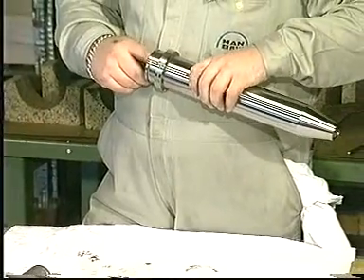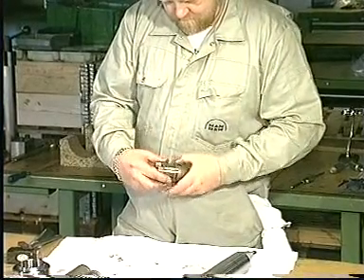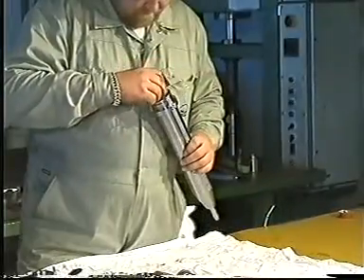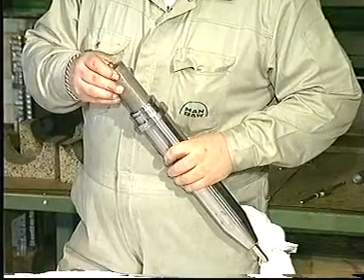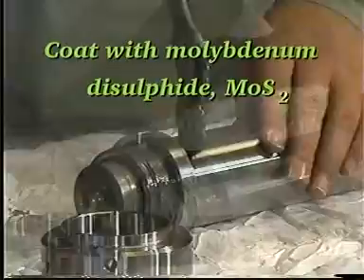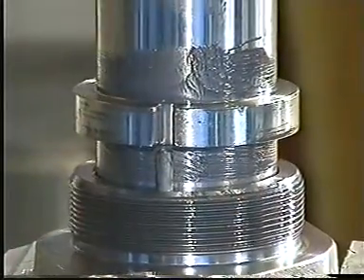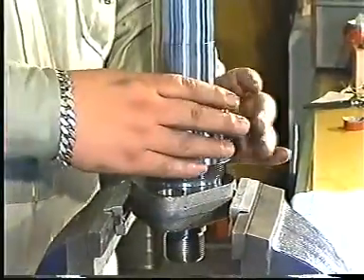Slightly compress the thrust spring and mount the circlips. Mount the fuel nozzle in the valve housing, making sure that it engages correctly with the guide pin. Mount a new sealing ring on the spindle guide. Coat with molybdenum disulfide and mount the spindle guide, thrust foot, thrust spindle with the circlips facing the spindle guide, and non-return valve. Mount a new sealing ring in the sealing ring groove. Mount the valve head, ensuring that the guide pin between the valve housing and valve head is correctly engaged so that it will prevent the parts from turning in relation to each other.